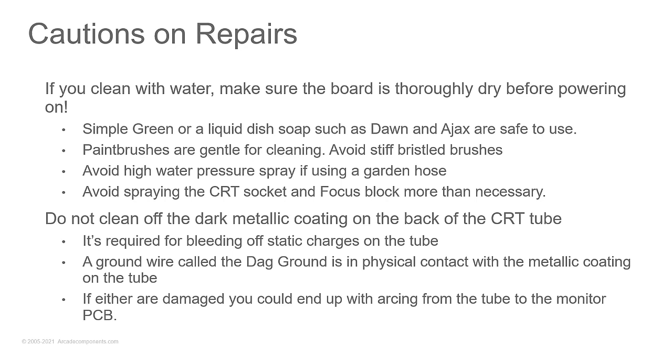Use a good soft paintbrush. You can scrub slightly with the paintbrush to get the dirt out of all the cracks and crevices and make everything look beautiful and new and clean, and makes it a lot easier to see all the crap that you want to see, like corroded component legs because of that stupid glue, or where something was spilled into the monitor. Look for resistors that look like they've been burnt through. Things like that become a lot easier to see once you get all that dirt and crap off.